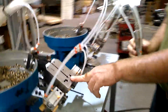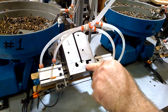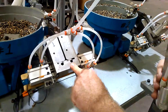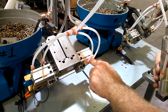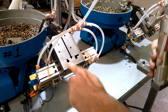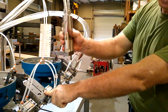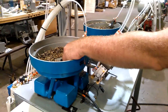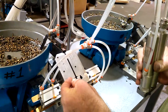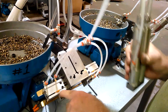You can see this is sliding back and forth. What's critical is that when this comes to the end, it is lined up perfectly with the hole. This is a little counterintuitive, but it's this sensor that recognizes when the unit is all the way over to the right, and it's this sensor that recognizes it all the way to the left. At the same time, this is extended when this is set up. It's a common problem where somebody has disconnected these and gotten them in backwards — and that can be a big problem. This is working the way it's supposed to. I'm going to deliberately put a screw in here, and you see it can't come over. The sensor didn't come on, and that's why the system stopped.